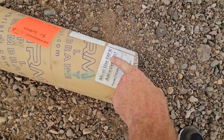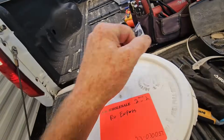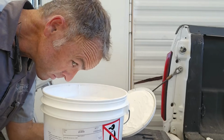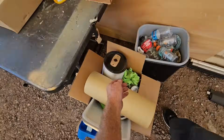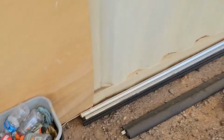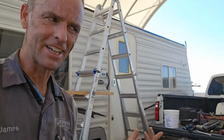It says it's pretty vital that we use EXP 90 only as far as adhesive goes. So here we go, Extreme Ply designed for RV roofing, EXP 90. Now suspiciously, it looks and smells like Elmer's. What was that, Cass? Smells and looks like Elmer's glue. Like Elmer's glue, which also looks and smells very similar to this Dicor 901BA, which is what you're going to use for TPO and rubber roof membranes. I'm not a material specialist, so always use the correct adhesives, but it does seem very similar to me.